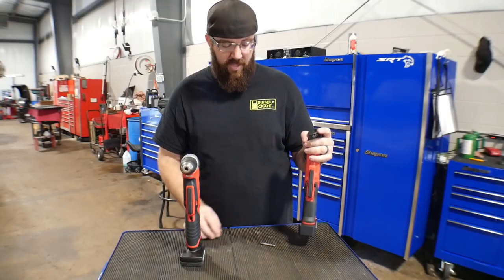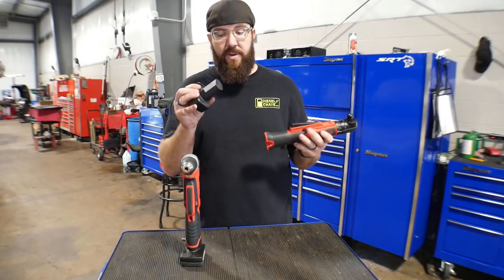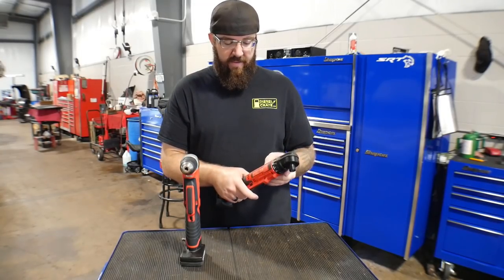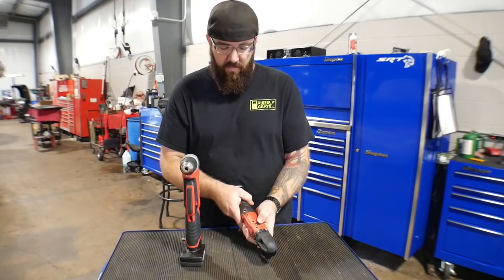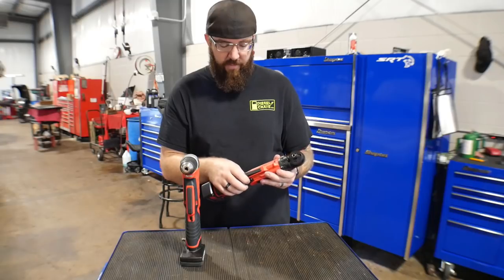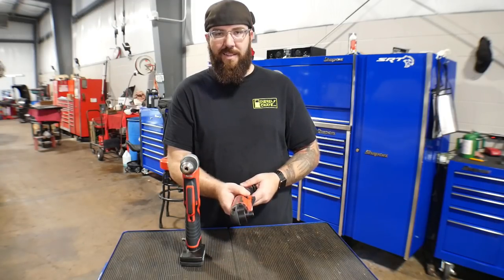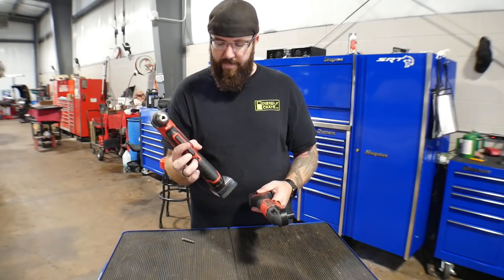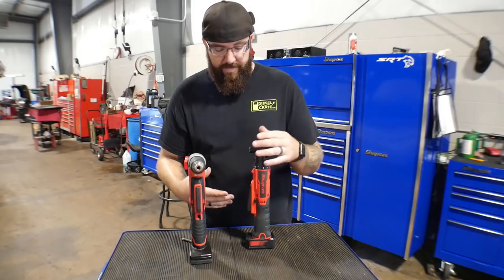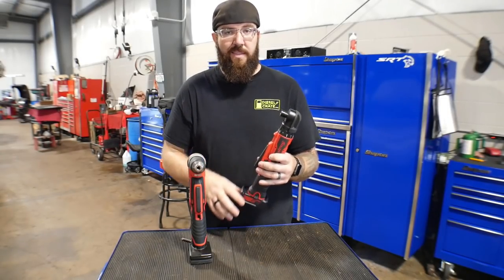Whereas the Snap-on only has a one-year warranty. They do market to guys in shops, so I'm not sure if that's why they only give it a year, but it does have a one-year warranty. The batteries on the 14.4 line have a two-year warranty. As for negatives on the Snap-on — one issue I noticed is that the speed selector likes to get caught up right in the middle. Every once in a while, I had to give it a little chuck just to switch it back and forth. I'm also not a big fan that the button for the reversible trigger is so clicky and pretty tiny — the Milwaukee has a flip-back-and-forth flap trigger. Other than that, this one came out on top on battery life, torque, and speed.